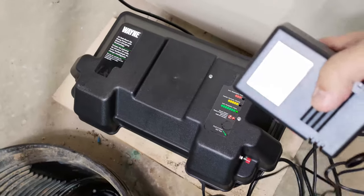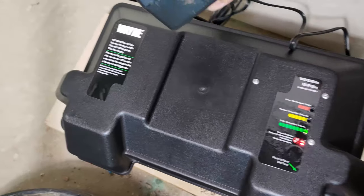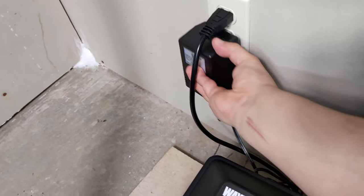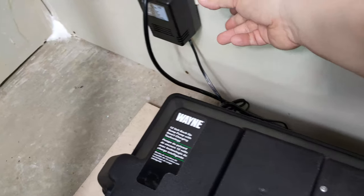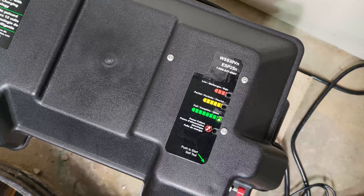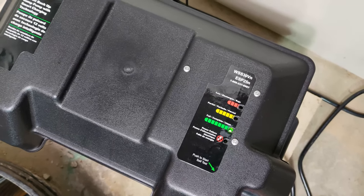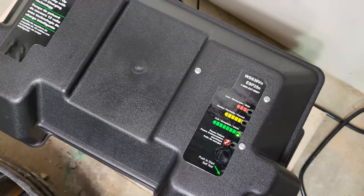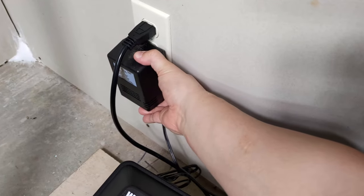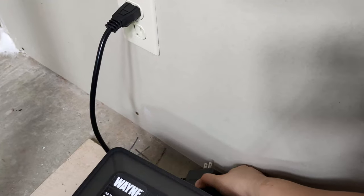After confirming the backup battery system is functioning correctly, connect the AC adapter to a wall power outlet. The backup battery red LED light should no longer be on. Test the loss of electric power alert by unplugging the AC adapter.